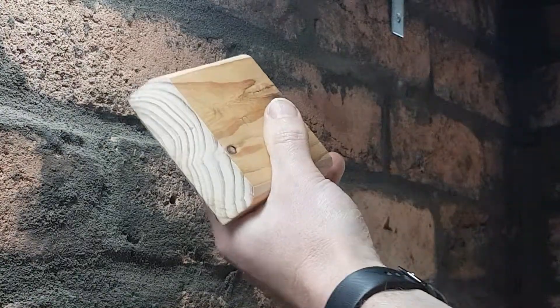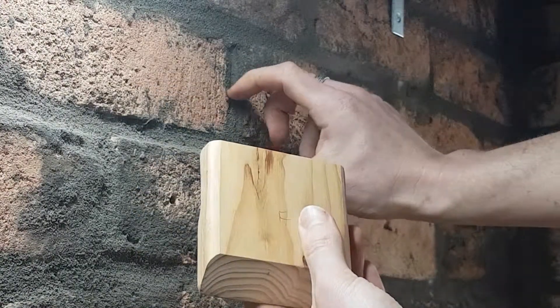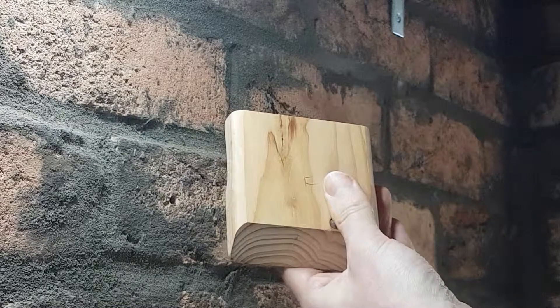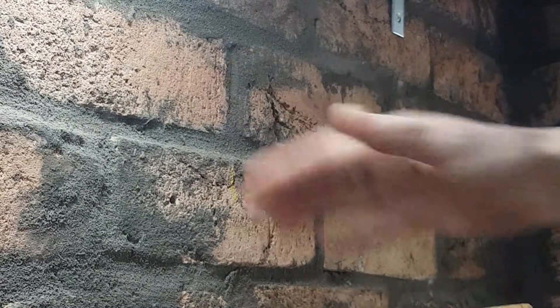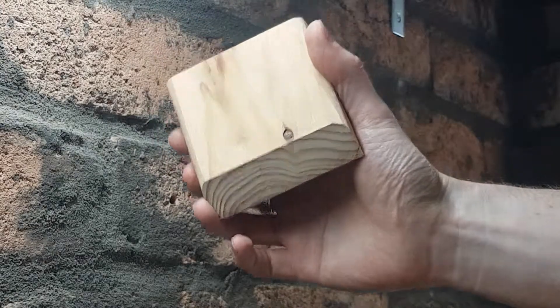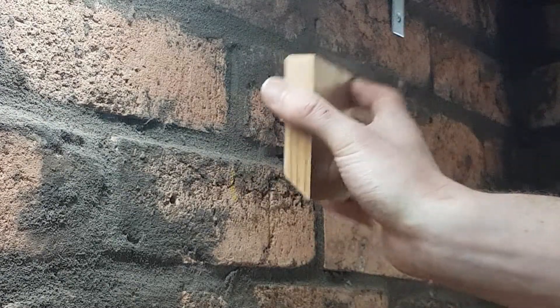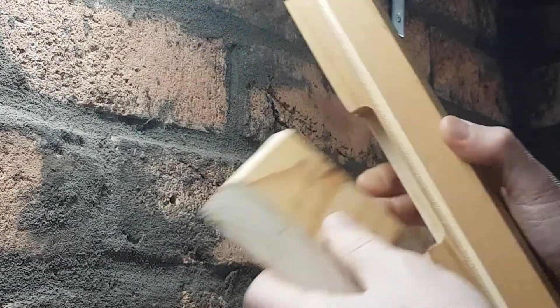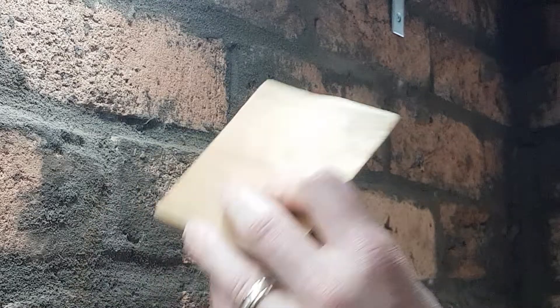Fortunately that's not a problem because I haven't glued that bit in yet. So to compensate for the upward movement of the wall mount, all I need to do is take a centimeter off the top of that and we'll get it fine. Better than that, I'll be able to mount this to the wall first without any real fear of it not fitting right, because since I haven't glued that on yet I can keep very slowly trimming until I get it down to the perfect settling height. It just goes to show — be careful when you choose to glue things together, because if I had already glued that piece in I would have had to be cutting the 45-degree bevel, and that would have been a lot less fun than shaving it off at the top at 90 degrees.